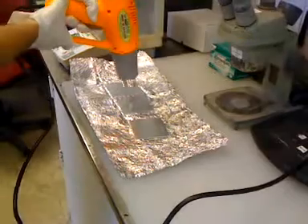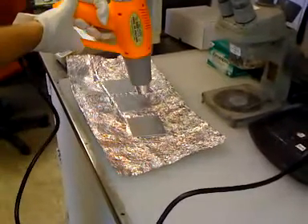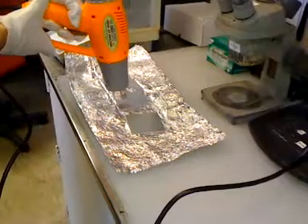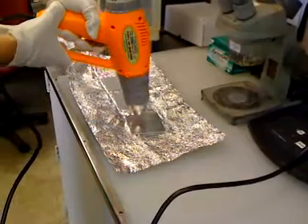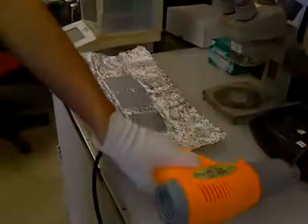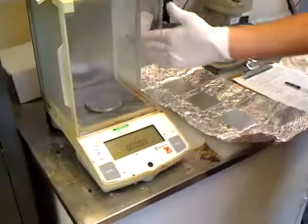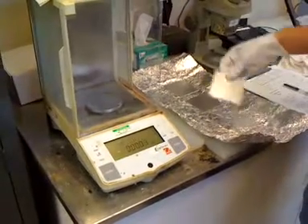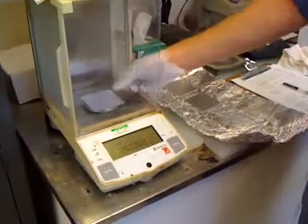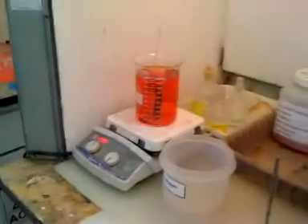Just to be sure before the next weighing, we use a heat gun to thoroughly dry the panels additionally. After the initial drying with the oven, the only other drying needed is with compressed air and the heat gun. You dry the coupon thoroughly on both sides, and then we're going to weigh the coupon again. Since we've subjected the coupons to the chromic acid solution, we're going to notice a weight loss.